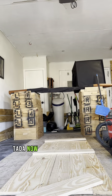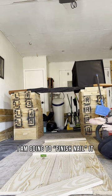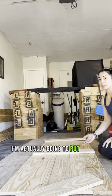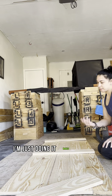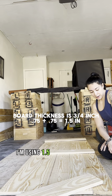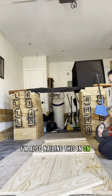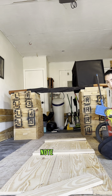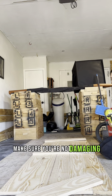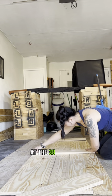Now that my middle board is completely centered, I'm going to finish nail it onto the door. I'm actually putting screws in during this finish nailing portion — fully optional, but it makes it extra secure. I'm using 1.5-inch finish nails and nailing on plywood so I'm not damaging the floor underneath. Make sure both sides are flush at the 38 and a quarter mark.